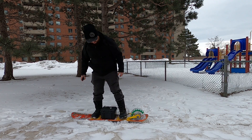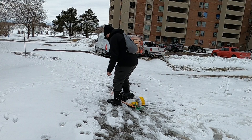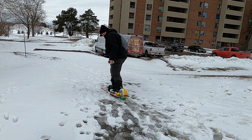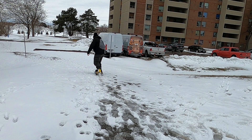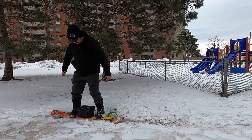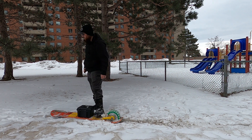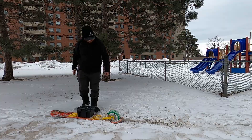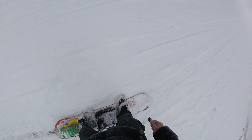I should note that this entire design is only meant to work in specific snow conditions. There's no way this wheel can have anywhere near enough surface area to work in pure powder — the wheel scoops need to press against something solid underneath the snow to push you forward. I find that I'm able to get this to work with 2 inches of snow or less; anything more and you might just be spinning in place. Underneath, you need something denser, like densely packed snow, ground, ice, etc. You also need to give it a bit of a push start or a rocking start to get that first bit of momentum going.